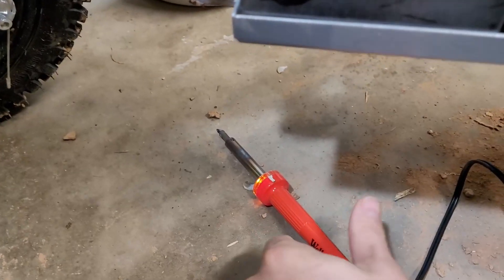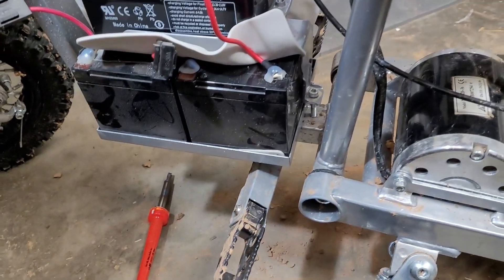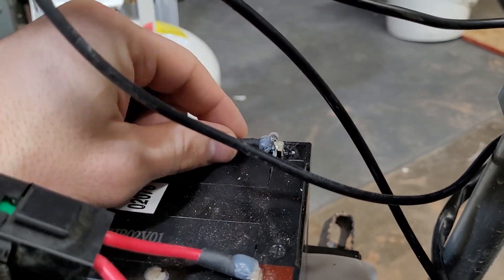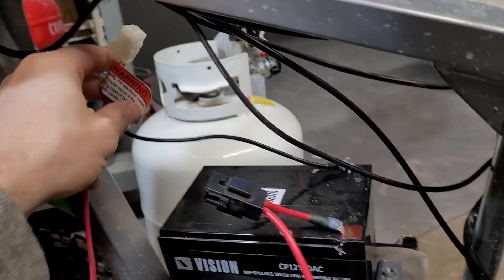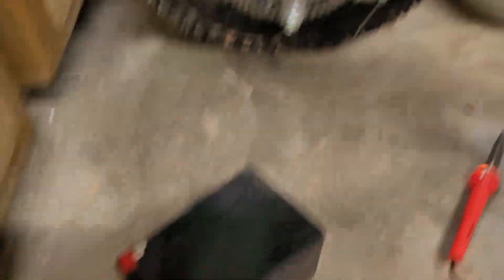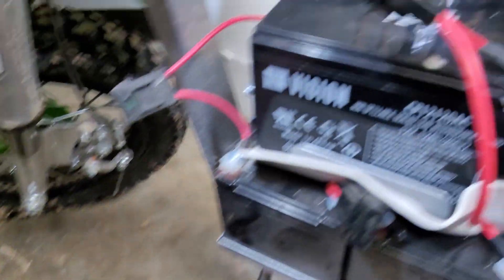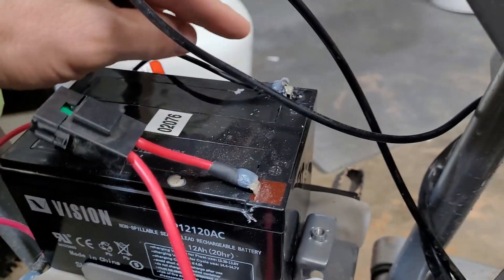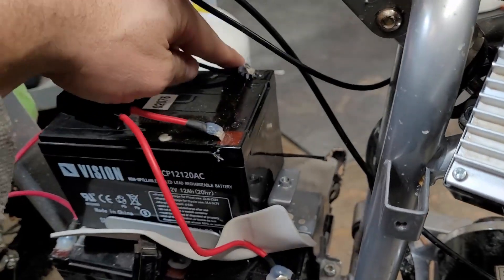Here's the plan. I've got my soldering iron going — I'm using the big 40 watt iron. This connection is soldered on right here, giving me my 36 volts. I'm going to desolder this, then solder this connection onto the negative terminal coming up here, then take the positive terminal on this one and solder the positive to the negative of the next battery. I'm continuing to loop positive to negative — I'm literally just adding one connection, I'm not even touching the other connections.